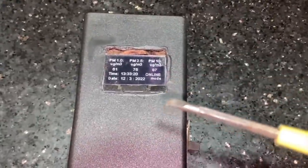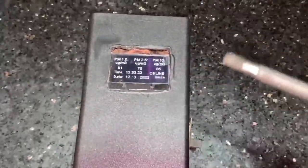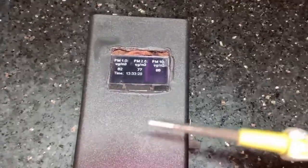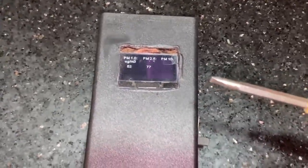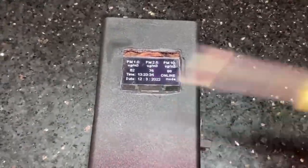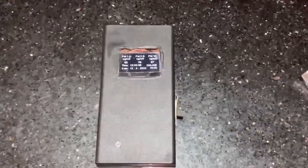These kinds of devices are very useful for giving you an idea of the PM concentration in your ambient surroundings. They can be used indoors or outdoors. These run off the ESP8266, which is a very capable little microprocessor that can also host a Wi-Fi network, allowing it to upload to any website of your choice. That's the whole working principle of this device.